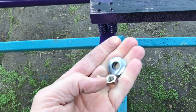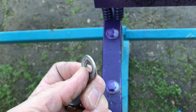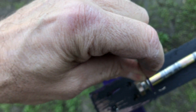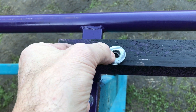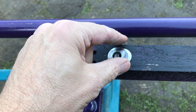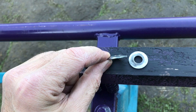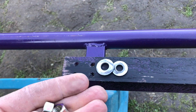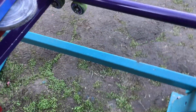But let's look at the non-grade 8 steel washers. This washer used to be perfectly flat — it's bent up right here just like that. There was another washer on top of that one, also bent. In engineering terms, this is what we call when a piece of material yields. Deflect means it'll bend and then bend back; yield means it just gives in — it's bent now.